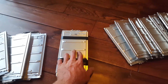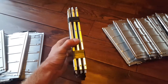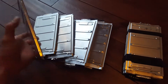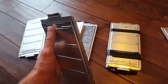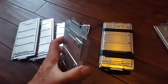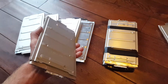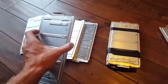This is a 2P3S pack that I made. This is 8200 milliamp hours, or 8.2 amp hours. These used to be a 2S configuration, but I separated them with these clips. I cut the tabs on both sides and spun the cells around, so now these are a 2P1S — a 4.2 volt battery at 8.2 amp hours.